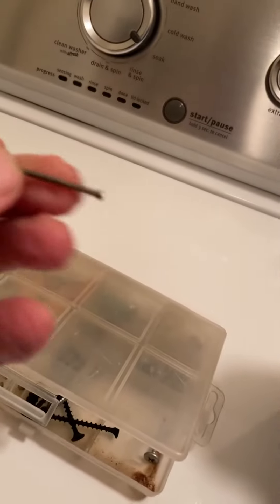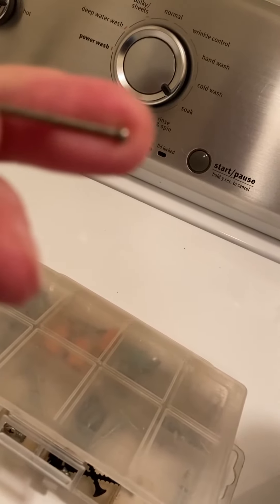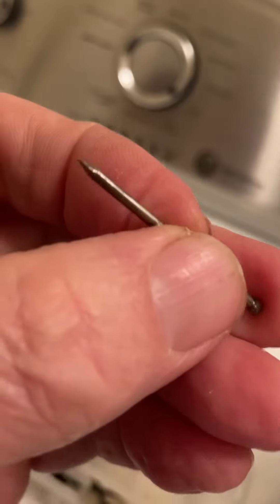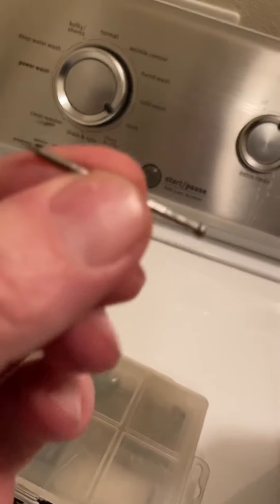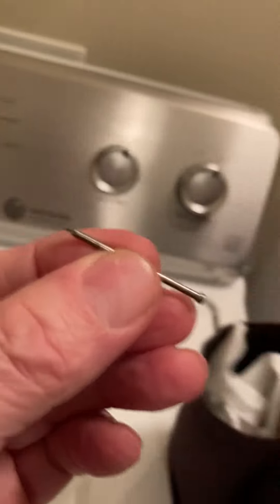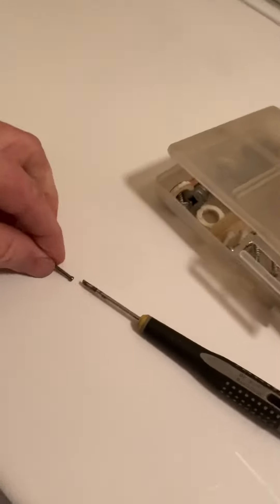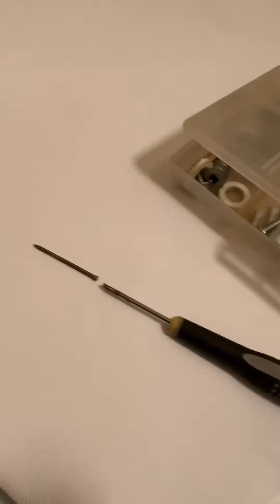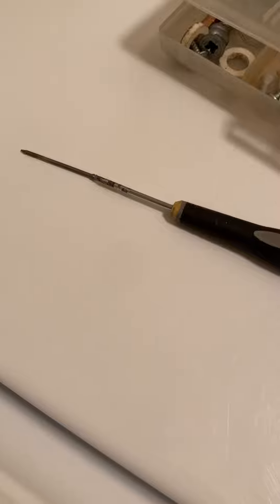See, finish nails. But again, if you notice, you've got to do it the right way, because right there — take her — and there's your sharp end. You don't want to tussle with that. Use a hammer. Then you use a set, or I like to use just a little teeny tiny center punch like that, to go on after you get it in. You hit your hammer on this end, line it up with this end here like this, and that sets it down below the wood surface — just a teeny tiny touch.